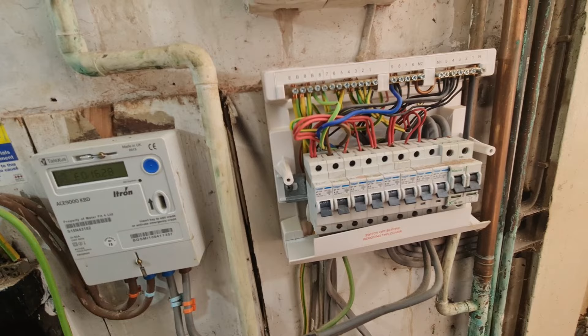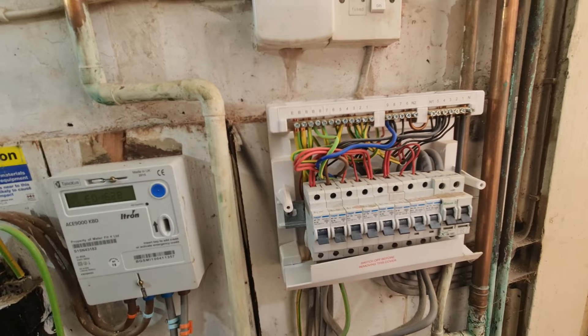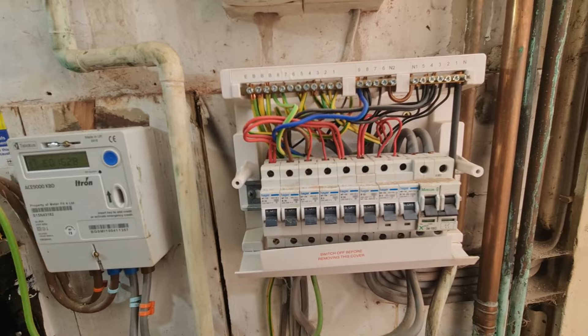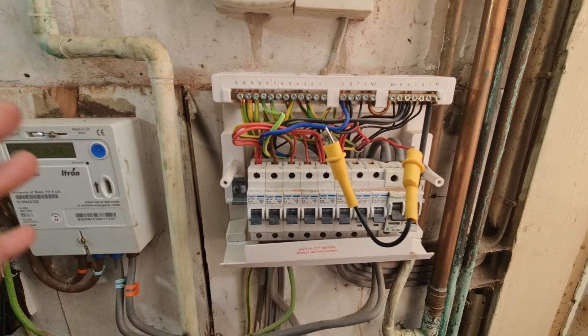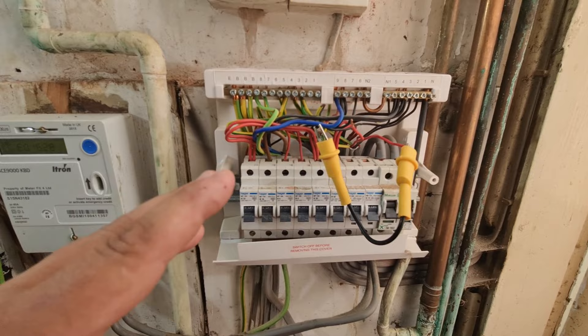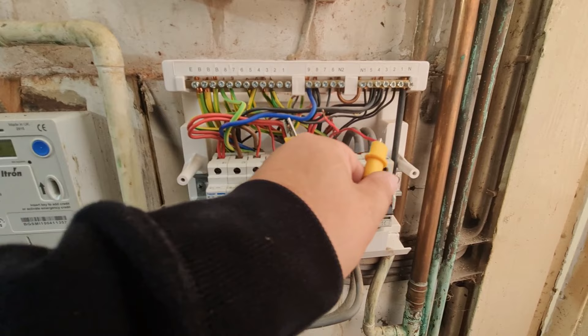I may show a little bit of testing here and there as we run through it, but I'm not going to do start to finish - I've done that on another video or two already. So I'll just pull in and drop bits and pieces here and there. I've done those brief little checks I always like to start with at the beginning of the EICR. Now we're going to run through and check our R1/R2 on the lighting circuit. I've disconnected the CPC from the earth bar and also the line, just to make sure I don't introduce an error when I'm putting things back together.